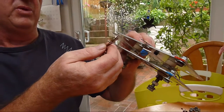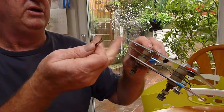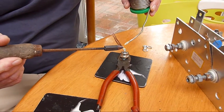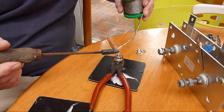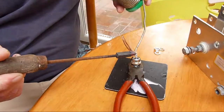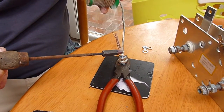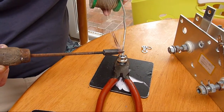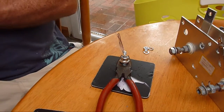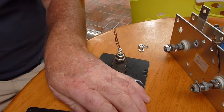You can't use a shrouded cable, because if there's any heat generated by the electricity flowing through, it could actually cause a fire — hence the original ones have no shrouding, so we'll do the same. To solder it, you'll need the appropriate flux, and we're using an old-fashioned iron because they transfer a lot more heat. You may even need to heat it up a couple of times. It's just starting to run now — keeping it in a pair of pliers also helps with the heat transfer.